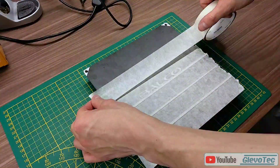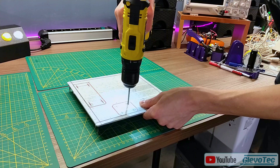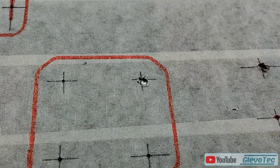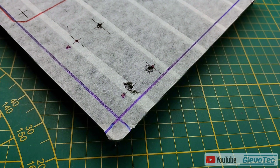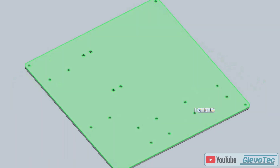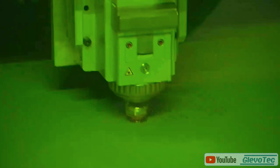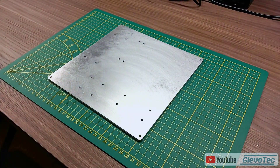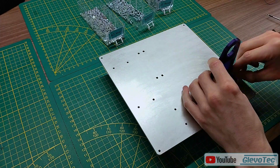I prepared the build plate to drill the holes to mount the 3D printed parts. At this point I realized that the material wasn't just plain aluminium — whatever I did my drill didn't catch and drifted on the surface, despite center punching before. Somehow the material seems to be hardened at the surface, so I had to change my plan. Luckily I had the whole layout right in my 3D design, so I exported the base plate and sent it off to be laser cut out of a 4mm sheet of aluminium. And there it is — no drilling even required.